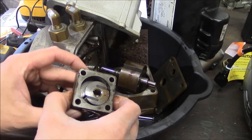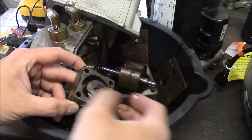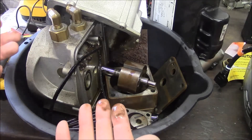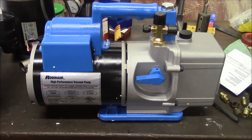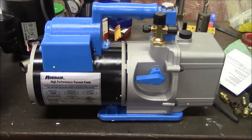It's just a super simple two-stage rotary pump, and it's just got these little reed valves and a couple of little rotors. There's not really much we can do with this thing. The part number on the original vacuum pump is RA15425, and that's a 6 CFM vacuum pump designed specifically for the recycling machine. I called the distributor and a new one is available — it's about $700.